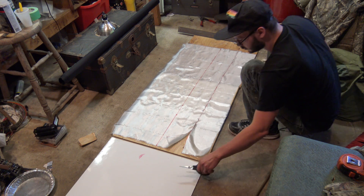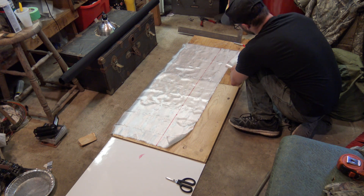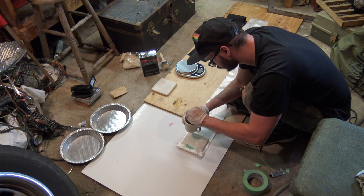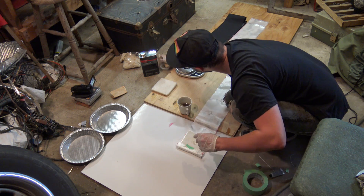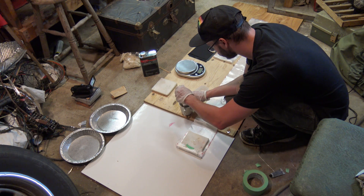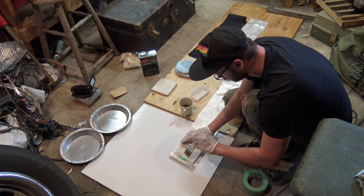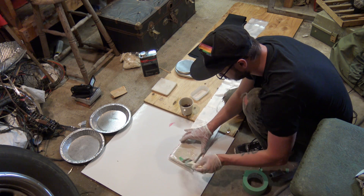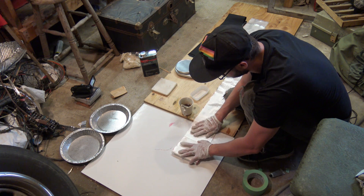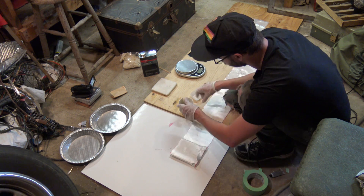Just look up Kevlar shears. I cut them into four-foot sections, gently folded them, and set them to the side until I was ready to laminate the plate. Then I applied a small piece of tape to the plate itself and the fiberglass, wrapping it on one side so I could start laminating by folding it and pressing the resin down, keeping it really tight. I didn't want it to slip and create air pockets because void spaces kill any composite you're working on. You always want to minimize air pockets — a good way to do that is to press it or vacuum bag it.